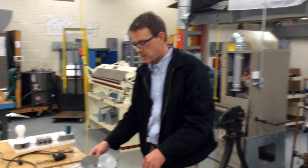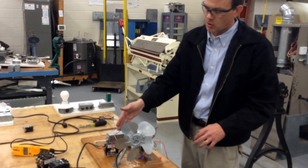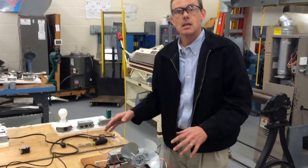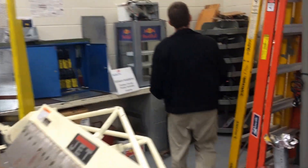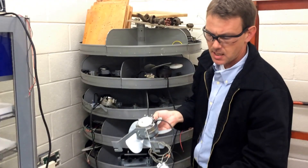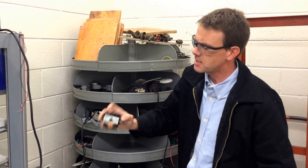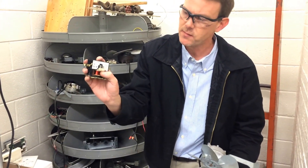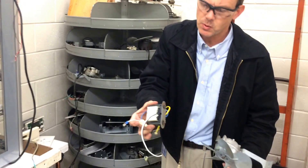These are all parts we've gotten out of other pieces of equipment. The goal now is that they're not just wiring up a single pole switch, but they have a contactor that's going to control the fan motor turning on and off — this is just a simple shaded pole 8-watt fan motor. When you need this stuff for the project, come over to this bin. You're going to grab your fan motor, your line voltage thermostat — which came out of an air conditioning unit, refrigerator, or water cooler — a single pole contactor (though it's got two poles). Make sure on the side the coil voltage says 24 volts. The last piece you'll need is the transformer, 120 to 24 volts.